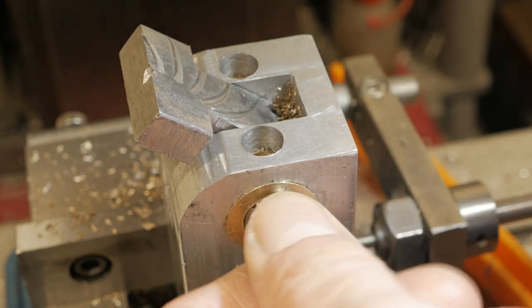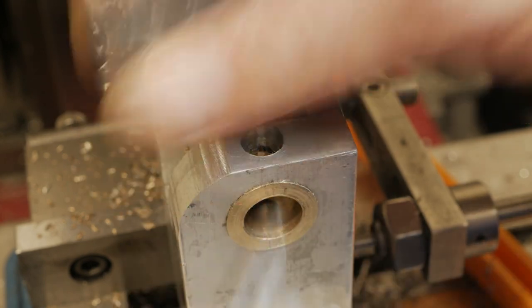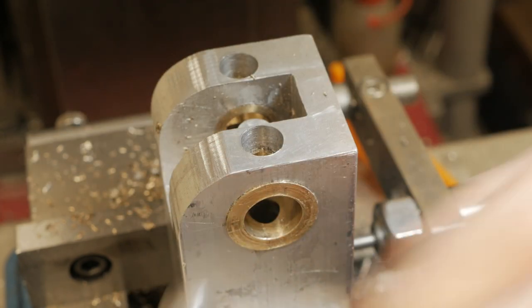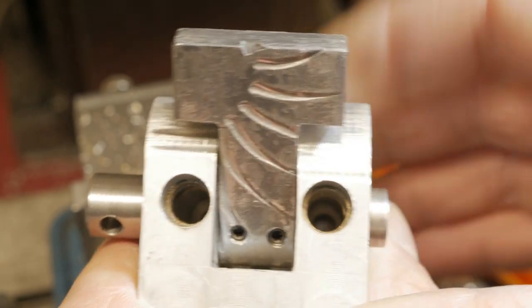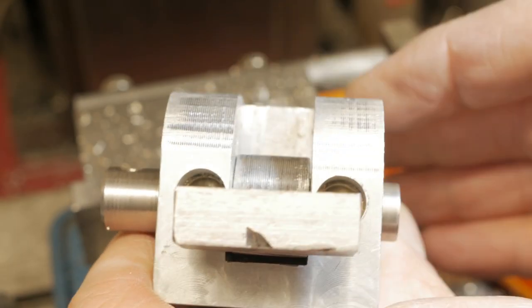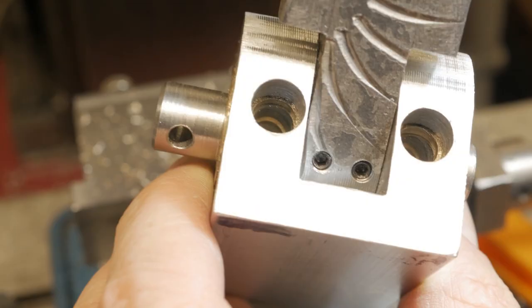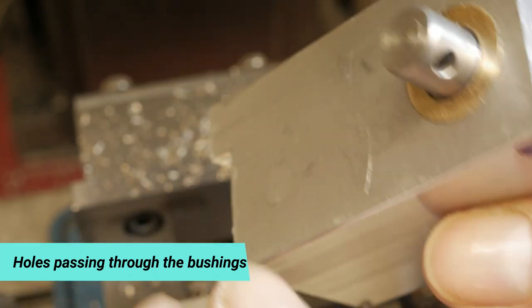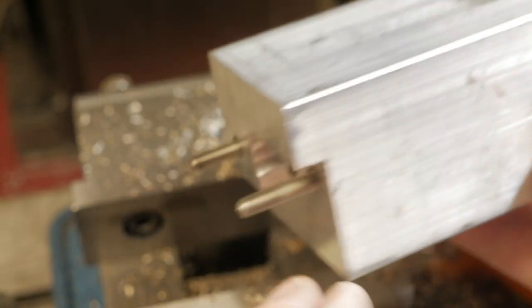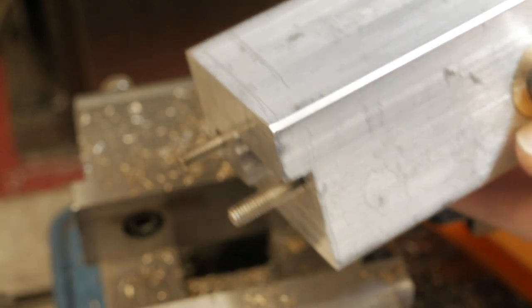The drilling diameter was very important. Not too small, to not get the screw stuck inside, not too big, to not completely cut the central shaft. The strange workmanship that you see is the result of moving the piece being processed. I decide to use the piece anyway, even with these strange carvings.